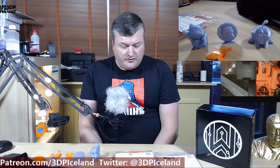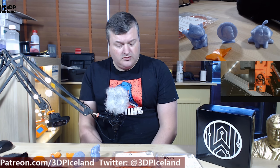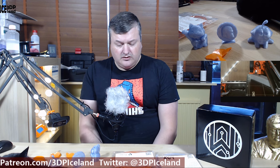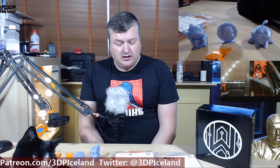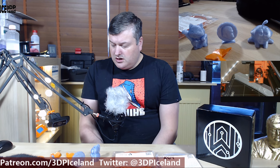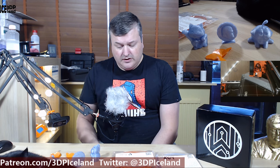The recommended temperature was 235 to 250 degrees, but after digging around online I saw people were printing at 275 degrees. I even tried that and still had trouble with layer adhesion, and I got a lot of warping with this filament as well.